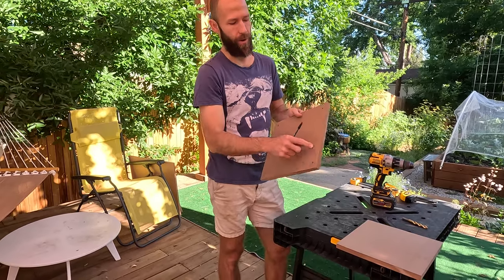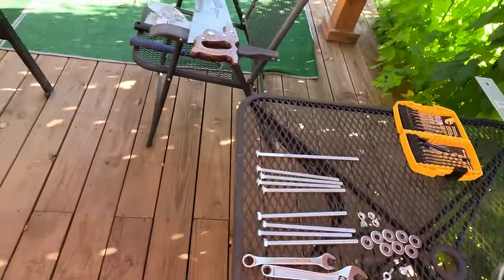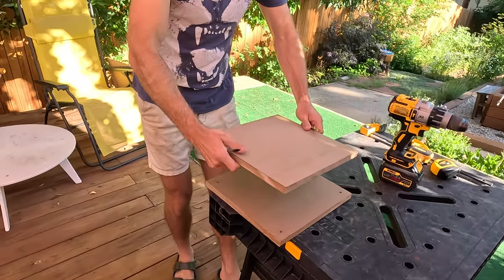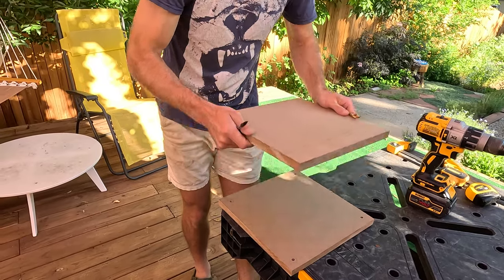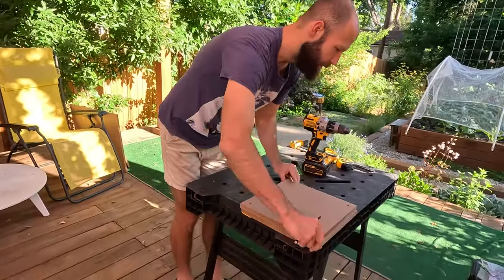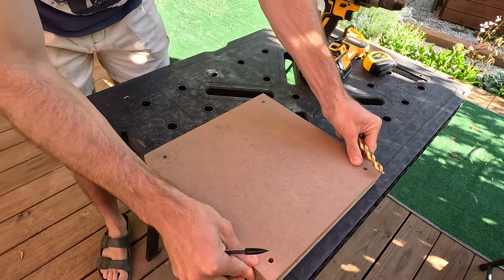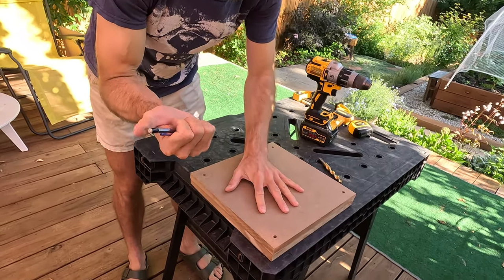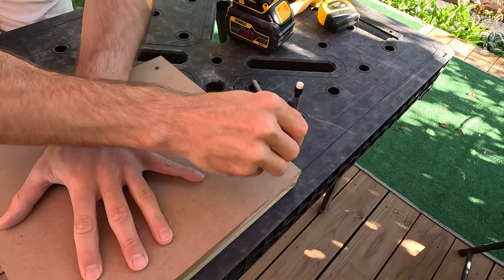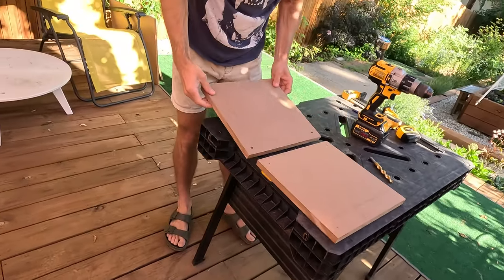Now this is your bottom plate — you use 5/16 inch. This is going to be a half inch drill bit, and that's going to be for the top plate. When you're putting on the top plate of the press, you always want the holes to be bigger so you have more wiggle room to easily take the top plate on and off. You take your bottom plate that has all the holes already on it — basically your template. Line it up, take a pencil, and mark an approximate place where you're going to be drilling. Remember, it's a half inch bit so it's going to be bigger than these holes.